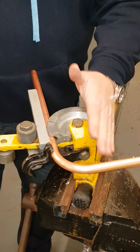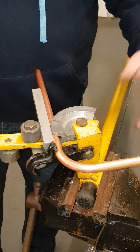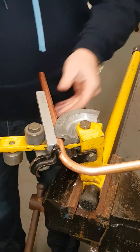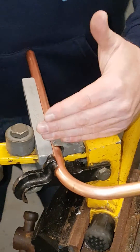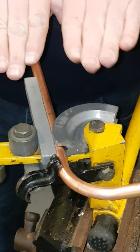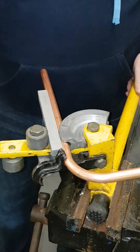You wouldn't have a vice on site, so we're doing it on a vice just for demonstration purposes. We need to make sure this is actually dead flat. If not, when it comes out of the bender, one arm will be actually facing downwards because the bender's twisted.